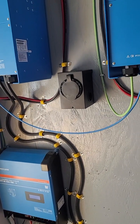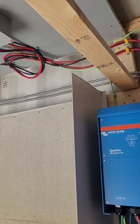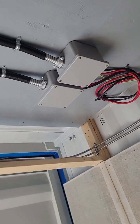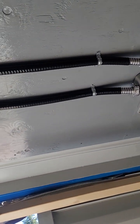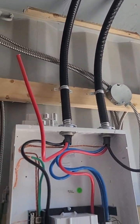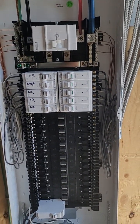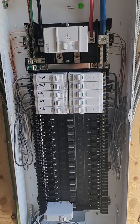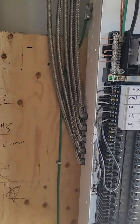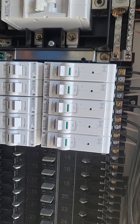A little more about this install: we have 20 amp wiring for the branch circuits going into the junction boxes. It's configured so that if we wanted to, we could add two more 5 kilowatt Quattros, and it's operating on two legs. There's a 200 amp main breaker in there — we probably should swap it out for a 100 amp for the time being. All the breakers are smart breakers, which makes it a bit more manageable.